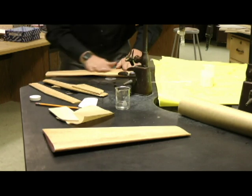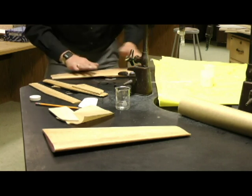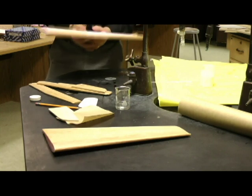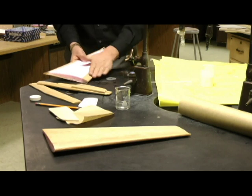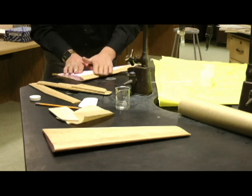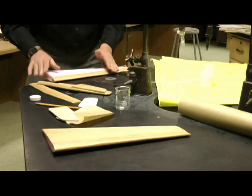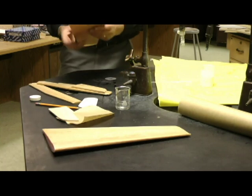As the air bubbles go out, you want to get them out as soon as you can. If you wait too long, they won't push out — the water starts absorbing into the paper and the paper doesn't push around. I've got those pushed out of that side. Then I come back to the leading edge and curl that back up around and just drag it. As you drag it you might end up with a few wrinkles — try to push them out of the way, they'll go right out. You can always lift it back up and migrate those out of the way. That side is done.